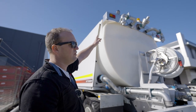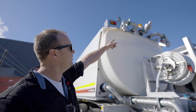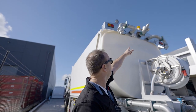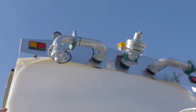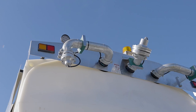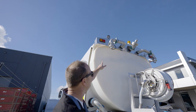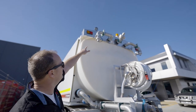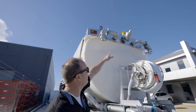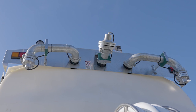Now we want to look up at the top of the truck. On this standard STG model, we've always got three sprays up the back — the big centre one in the middle, which puts out a lot of water flow, and then two smaller sprays either side, all individually controlled from the cab. Each morning, just have a look up there, make sure the airlines look secure into the spray heads, and make sure the brackets and all the nuts and bolts look tight. Check if there's been any rocks caught in the slits of the spray heads that could obstruct the sprays.